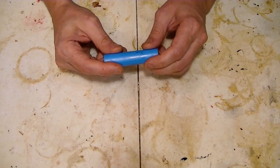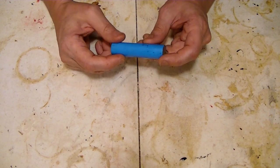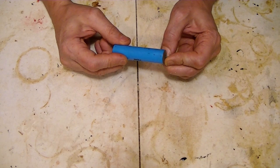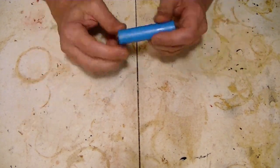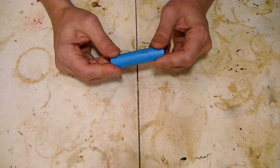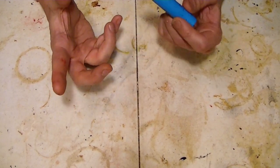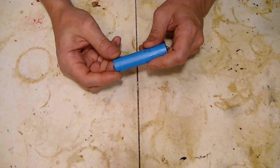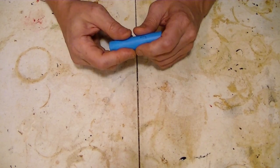So I finally got the Tesla coil working and figured it out. I was opening up the spark gap to see how much I could get it going, because the wider that is, the bigger the sparks and the coronas that come out the top. But that's also more electricity it puts onto the capacitors, because it takes more to build up before it's able to jump across there. And of course, I blew out the capacitors.